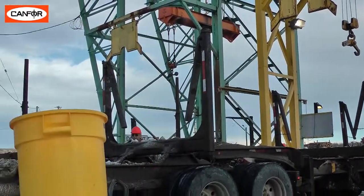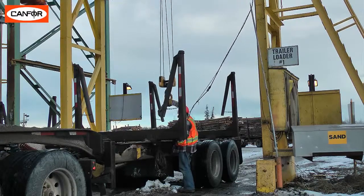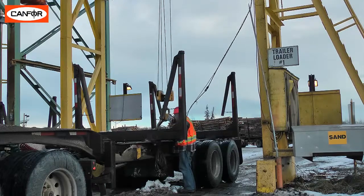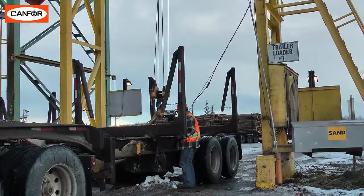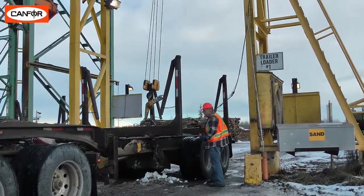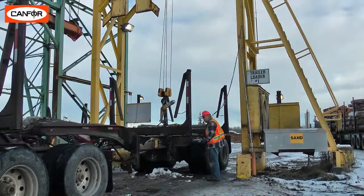Always position the hoist directly over the hook attachment to ensure a straight lift. Always check for damage to the hoist and/or cables and report any defects to the log yard supervisor immediately. When handling the trailer hook, always use the finger holds on each end of the hook to avoid injury. When the trailer is suspended, always look back on the way to your truck, as the trailer can sway out of position very easily if it is not being attended.